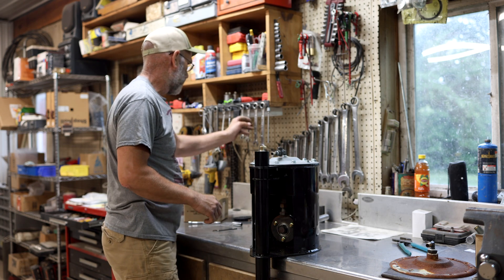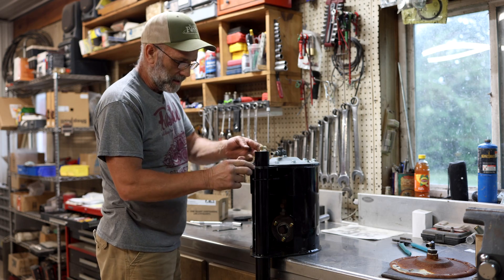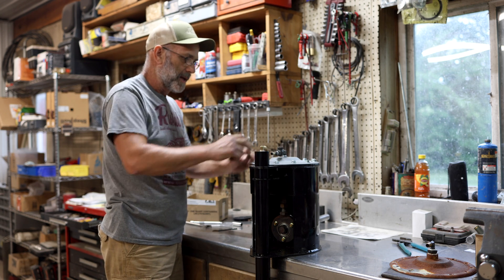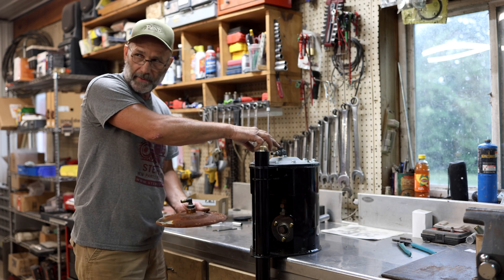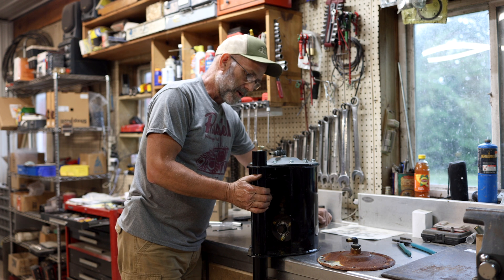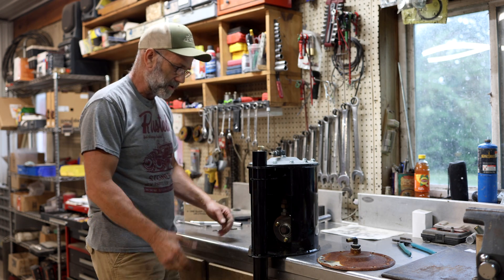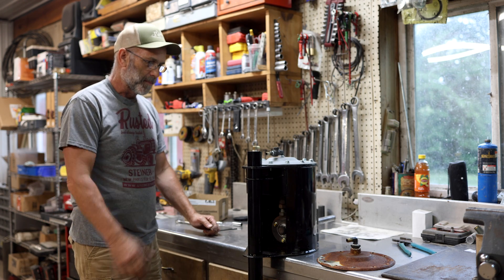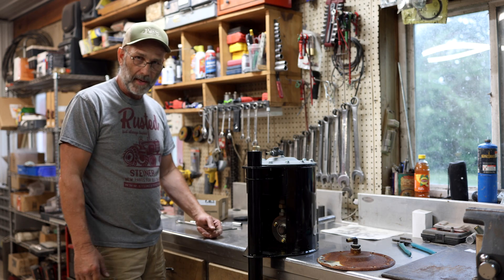Since I have a different lid, I'll need to move this pipe down a little so everything lines up. But you've got a check valve here and a check valve underneath the lid and everything is going to work. The old style has the check valve in here versus up here in this assembly — both just have to stop the air from going back into the unit. When the fan turns the shaft, the air goes in through here and out down the tube to the compressor. For all practical purposes this is ready to go back in service. If you have any questions, call us here at Fenders Fish Hatchery — I put these videos together to help customers rebuild them themselves. I also sell rebuilt units here at the farm, for both old and new style single diaphragm windmills. Thanks.